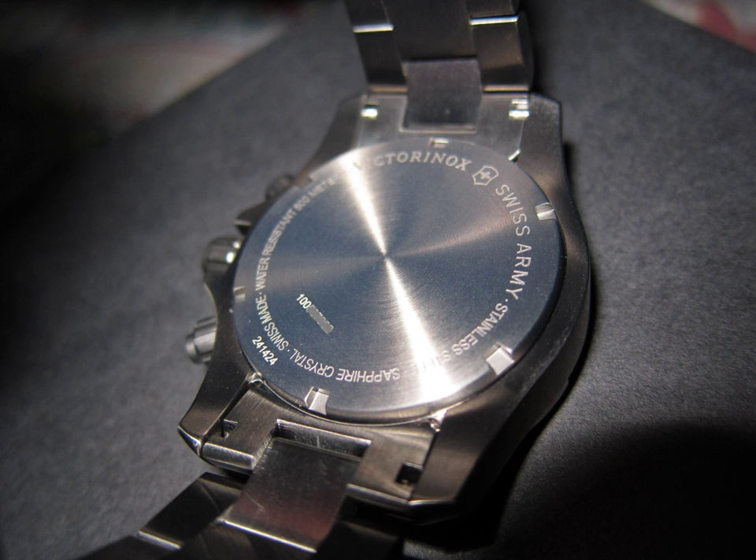The standards and features for diving watches are regulated by ISO 6425 Divers Watches International Standard, introduced in 1996. ISO 6425 defines such watches as a watch designed to withstand diving in water at depths of at least 100 meters and possessing a system to control the time. Diving watches are tested in static water under 125% of the rated pressure; thus a watch with a 200-meter rating will be water-resistant if stationary and under 250 meters of static water. ISO 6425 testing is fundamentally different from non-dive watches because every single watch has to be tested.